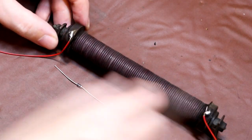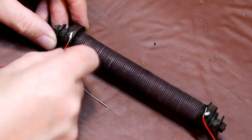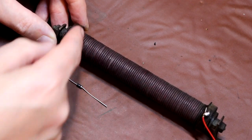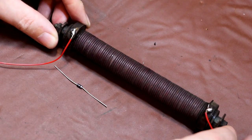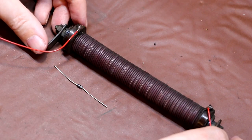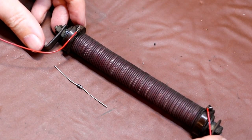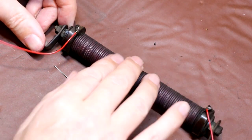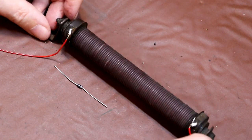And then at each end of the rectifier here, you can see they've just added a couple of terminals, and these are again just flat copper discs which make contact with the stack of diodes here. So the construction of this is really quite simple, and actually some of the early radio pioneers did manufacture their own copper oxide rectifiers at home, so that couldn't have been an easy process.